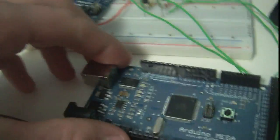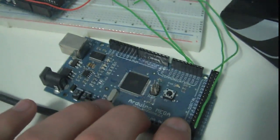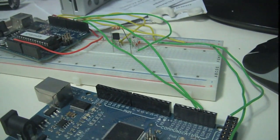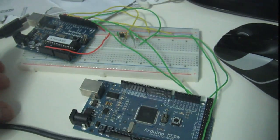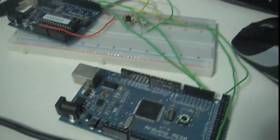This is the Arduino that's doing that. I should point out that in the original design, this is not going to be an Arduino Mega — I'm just using that for testing because it has multiple serial ports on it. So I can have this serial communication going to this Arduino and then the serial communication going to the computer on a separate serial port. But in the real design, it's going to be communicating to the SD card via I2C or SPI. It's one of the things from SparkFun, so I can probably get it to do SPI or I2C, and I can use a separate I2C bus on a regular Arduino ATmega328 chip, so I don't have to use my Mega.